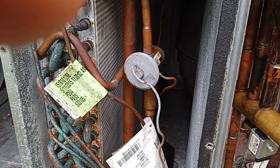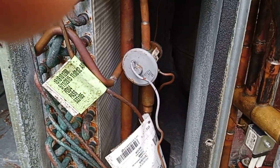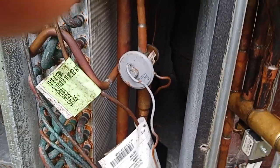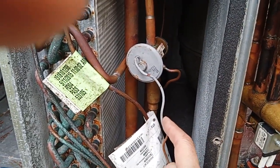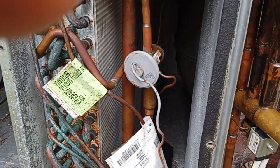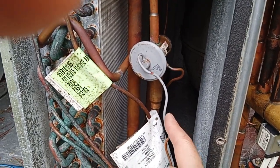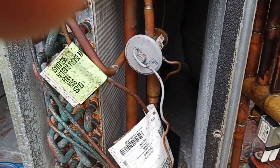After very careful thinking, I realized my thinking was backwards. The critical question is: what pressure on this capillary tube — as a temperature-related reference — equates to what pressure on the low side? And the answer is: the pressure on that tube is what sets the pressure on the low side of the sealed system.